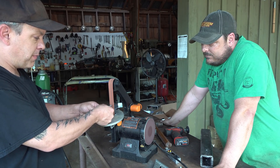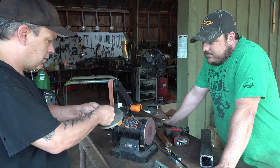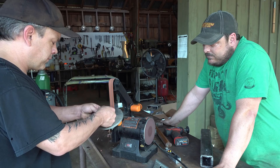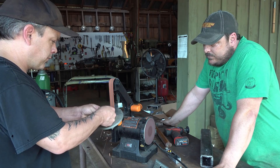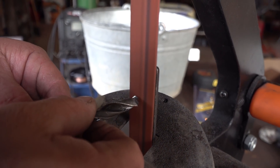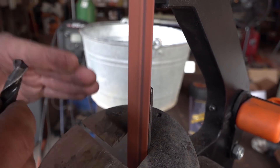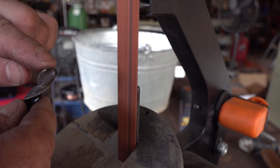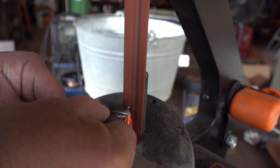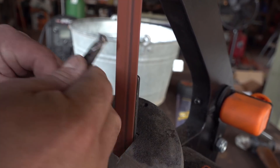The first thing we're going to go for is about 118 degrees included angle. The thing to remember here is not rolling the drill this way — what that does not do is give release clearance on the back. You can actually see this side is actually a little taller than the cutting edge. So the way you want to do this, you're going to lay into the cutting edge and get it straight up.